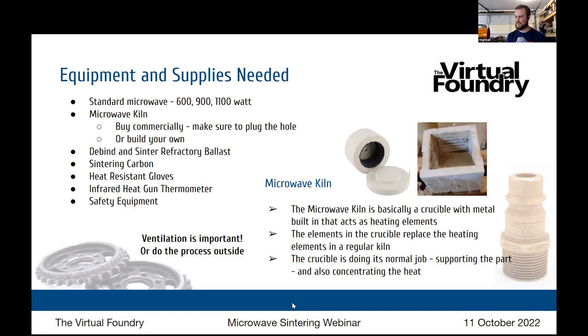The cool thing about it, I think, is being able to use the surface of the kiln to inlay, to embed the elements. I still think that's a cool concept. It's just that it did have some issues with the crumbling nature. But a side effect of seeing this is that silicon carbide gets quite hot. And I've noticed some areas in that version where the silicon carbide has certainly fused together in itself and is quite hard, which is something I'm putting in the back pocket, because being able to sinter silicon carbide is an interesting prospect.